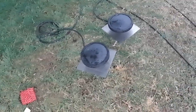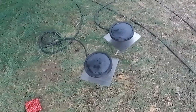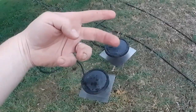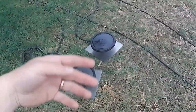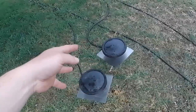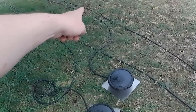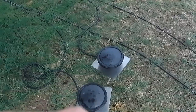For me, hopefully it won't be a big deal, because I don't really plan on ever shutting the pump off. But for a lot of folks that do shut their pumps off, when you turn the pump off, the air kind of comes out of the lines and some water kind of back flushes into the thing. The water is not really an issue, but the sediment and the silt in the water then goes back inside your apparatus, and silt's going to settle out inside your lines, inside that rubber diaphragm and stuff like that.